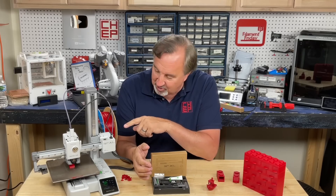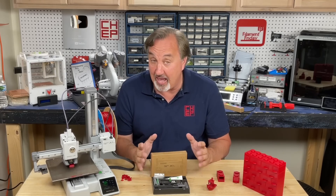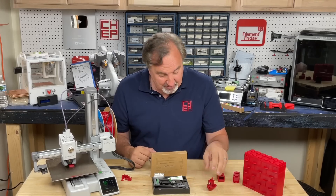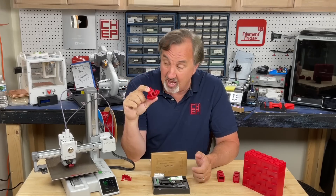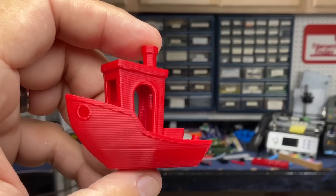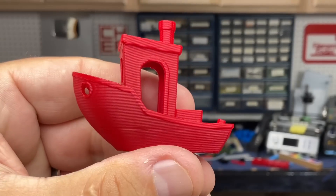Notice I'm talking the whole time this thing is printing a chep cube — it's that quiet. I can have this in the room while it's printing and it's printing twice as fast as the Ender 2 Pro. I think it's about a 17-minute chep cube at 0.2mm layer height. This benchy was the first thing I printed on it and it came out really nice — a 20-minute benchy, almost as fast as core XY machines, and this is a bed-slinger. The quality is phenomenal; I'll spin it around here — very very good. I can't even find the seam on the smokestack.